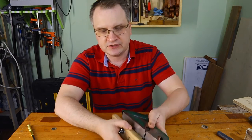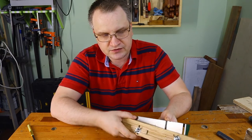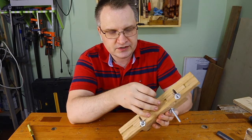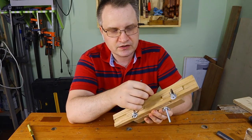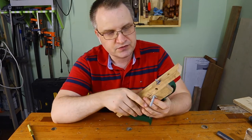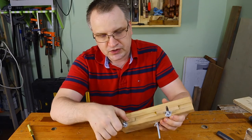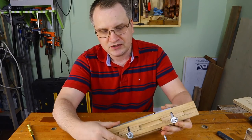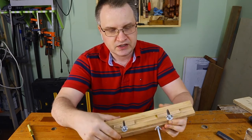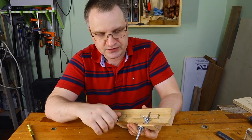So this is the fence. After playing with this a little bit, I realized it doesn't really matter if it's strictly parallel or not parallel - it's really about the length between the blade protrusion and the fence at that particular point. That's the actual point of adjustment. But if you can make it parallel, it will be a little bit easier to work. This is the minimal rabbet I can make because my piece isn't wide enough, so I would recommend using a slightly wider piece. But in any case, that's basically the whole construction - there's nothing special.